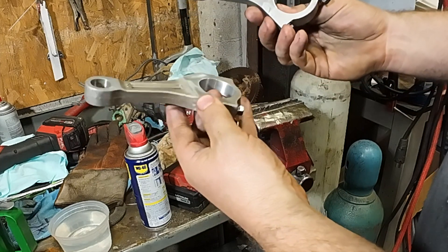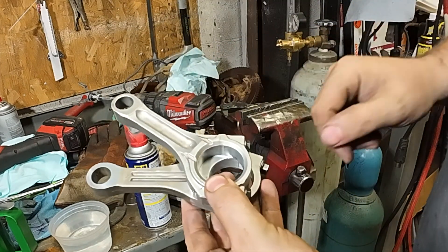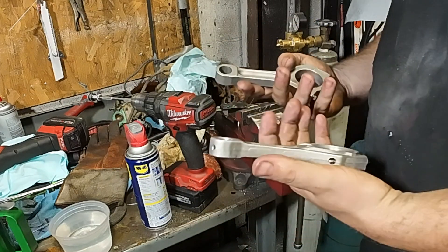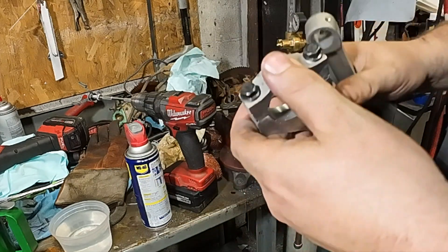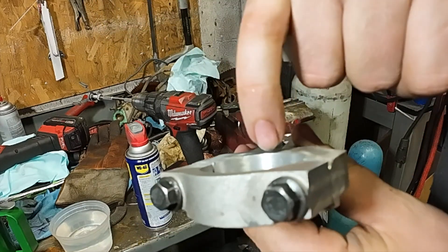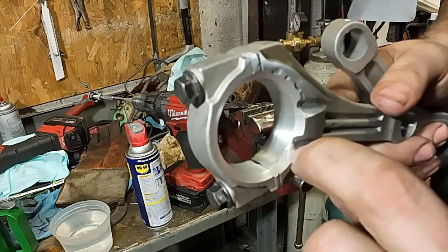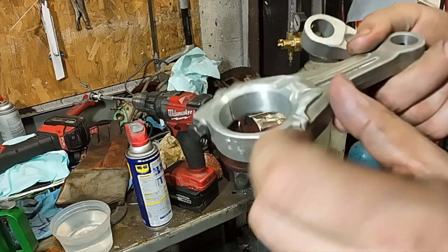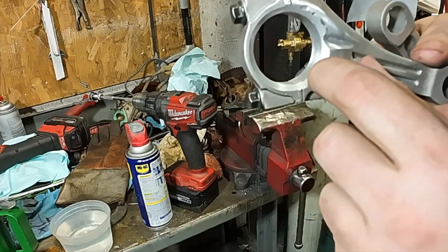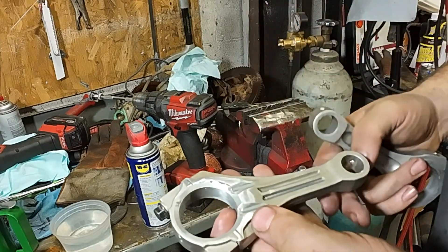This is how these go together in the engine — machine face to machine face, chamfer face outside to the chamfer on the crankshaft. If you had to be picky, there's some pitting and a tiny little low spot at the edge, plus some cosmetic flaws, but otherwise this is a 100% functional connecting rod.